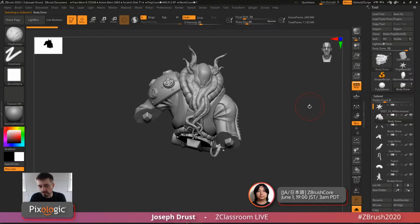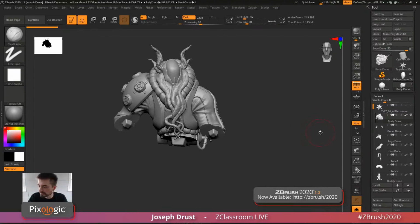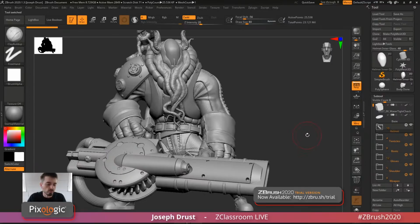I know you're always going to get supports with 3D prints when you're doing FDM machines, so you can't really get around it. I mean, you can get around some, but most of the time, just add the supports. And if you're using something like Simplify 3D, it's really easy to remove them so they don't hinder that much. All right, so that's the process there. We're going to go through and make all these little parts today, and then we're going to talk about some different things and some different workflows.